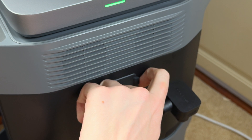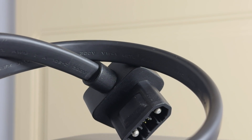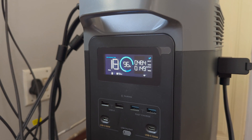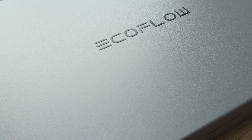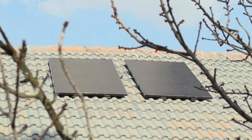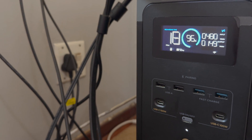The second mode takes the power and charges your Delta battery first. After it is charged, the power is then sent to your grid — a great way to keep your Delta battery topped up. You'll use this mode if you want to use your Delta battery at night to power your appliances and charge it during the day. There is a catch, however: if you have Prioritise Power Supply enabled with your Delta 2 connected, the PowerStream will take charge from your battery and contribute it to your home through the PowerStream's AC port. The solar energy won't be used to charge the battery while this is happening, and if you unplug the AC port, the solar input then gets cut off as well.